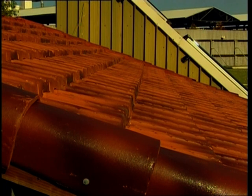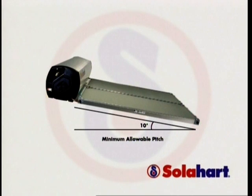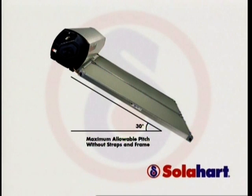Ideally, the heater should be installed on a pitch equal to the geographic latitude of the place of installation. However, variation in the pitch to within plus or minus 20 degrees of the latitude will have little effect on the total annual solar contribution. The minimum allowable angle of pitch of the heater is 10 degrees to ensure sufficient pitch for thermosiphoning and glass cleaning. At pitches greater than 30 degrees, the system must be installed using special tank straps and mounted on a cyclone frame.